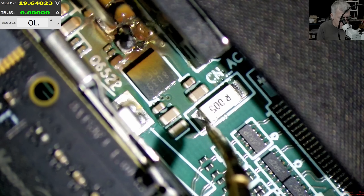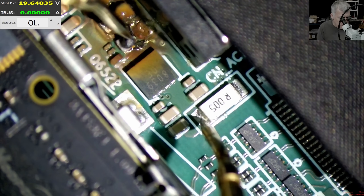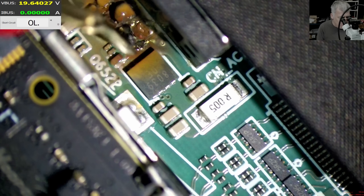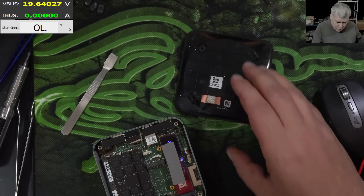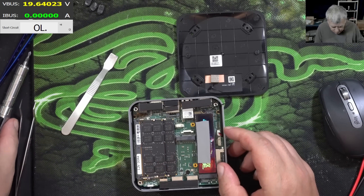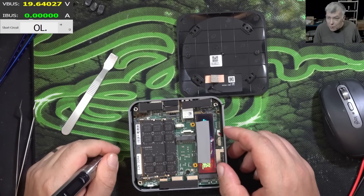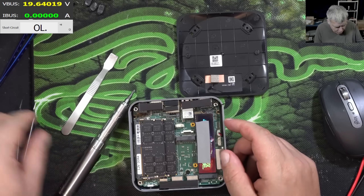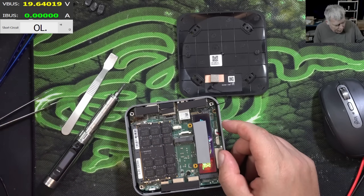So the MOSFET I can bet is fine. Check here — it's not shorted with the MOSFET. But the inductors are gone. Just fixing what exploded there is not helpful; we have to find the short. But the short looks like an easy job — let's open it.